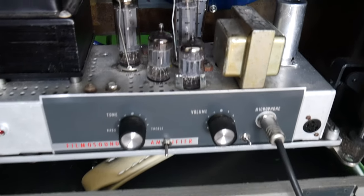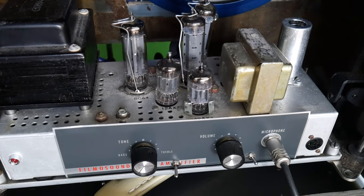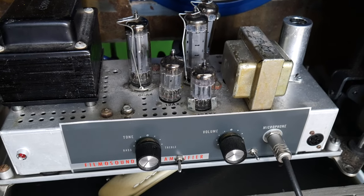This cab goes with this amp, and it's a 3x10. This amplifier here is a 240 volt, very rare model, 240 volts, EL84. It's really rare as well, because Bill Krinard put an EF86 tube in the preamp. Normally this model, because they only made this 240 volt model for one year, in 1965 I think, doesn't come with the EF86; it has a solid state V1 style preamp circuitry. So when Bill did the mods on this, he put that EF86 back in there, which is really cool.